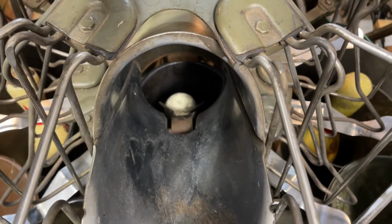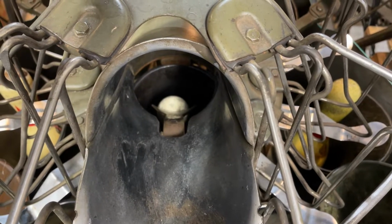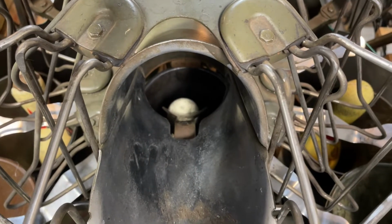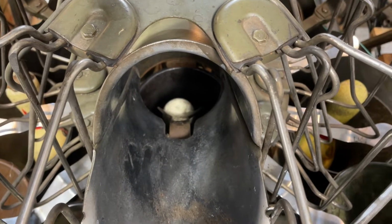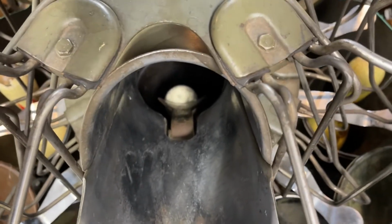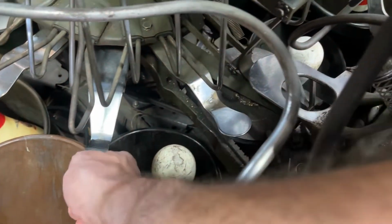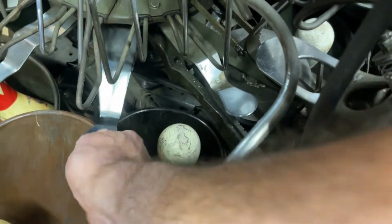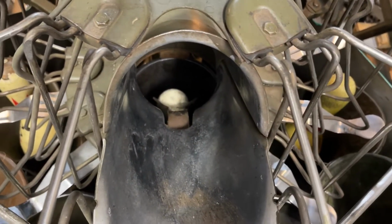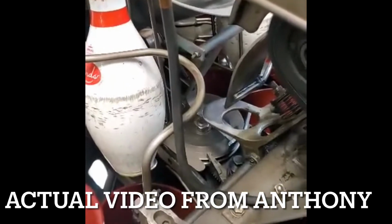So you can also take the tongue out, maybe grind a little bit off of it, maybe shorten it up a little bit. I know they make different versions of it. They don't need to be as long as that is, so you might look for a shorter version. But if you're having the 5 pin hang up on that pin release lever, your spider is open and will not lock. So that's one thing, that's a really big one to look for.